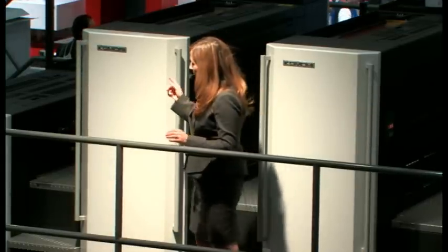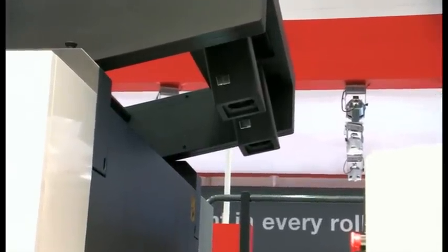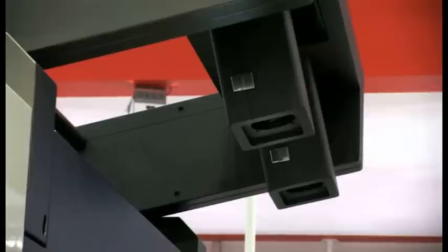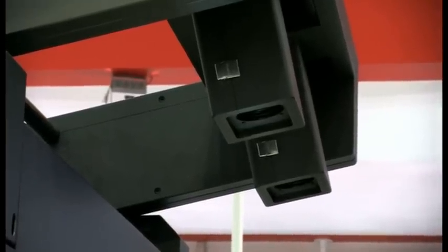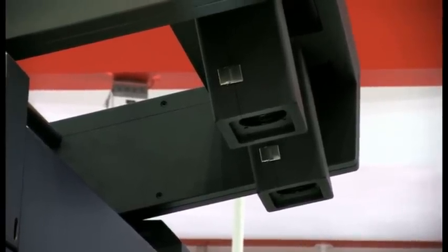Let me show you the double camera sitting over the last unit. This is the PQAS Print Quality Assessment System — an inline, high-accuracy print quality inspection system for package printing. The use of two cameras increases the image resolution four-fold, resulting in a substantial enhancement of detection performance.